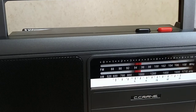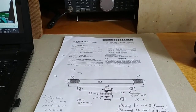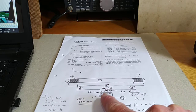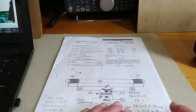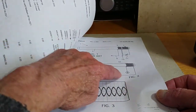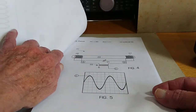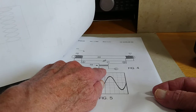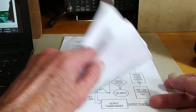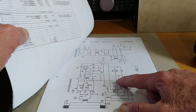Let's have a look at the twin coil ferrite antenna, what makes the radio special. Here's the patent — you can get this off the internet easily. The twin coil design has 40 turns on each coil with a matching network. Twin coils tend to cancel each other out because they're in opposite phase, so they've incorporated a phasing unit which makes the two coils combine to give one signal. The amplifier circuit uses a varactor diode for tuning instead of a variable tuning capacitor.